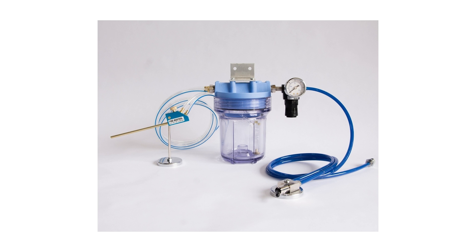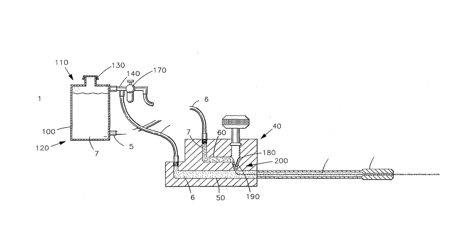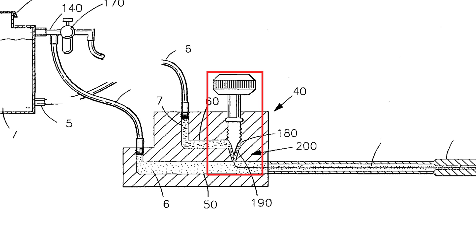You can buy the Fogbuster — it is very highly rated, coming in at about €200 to €300. So I wanted to try and build my own, and that's what I'm going to show you today. Looking at the Fogbuster schematics, you can see it's quite a simple setup — just one direct line from the air supply going out to the nozzle, with a needle valve that sits on top of that airflow.